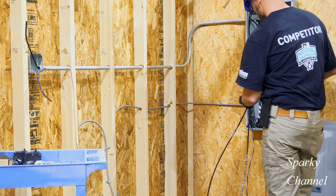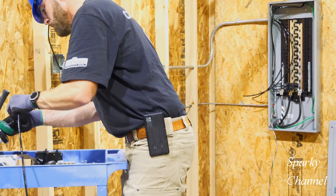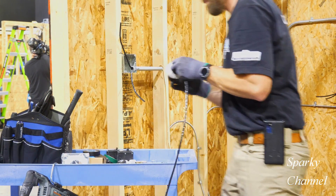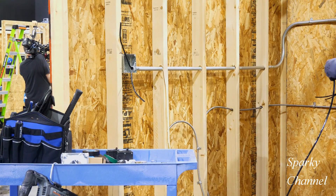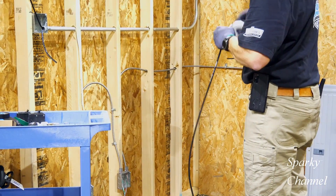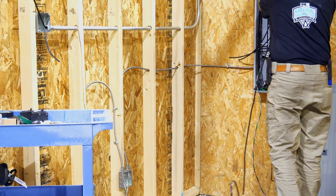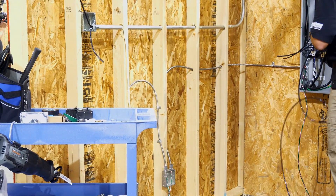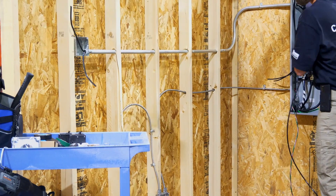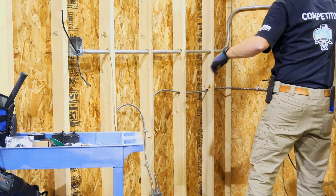Those two wires will be his hot wires. Now he has grabbed his white electrician's tape, and he will designate this wire as a neutral with the white electrician's tape. Notice that, once again, he's not going to use a fish tape, but this time the wire is going to be considerably more difficult to push through the three-quarter inch conduit. And, once again, these are four AWG wires — he's both pushing and pulling the wires at the same time.